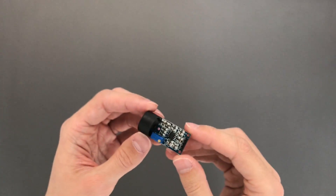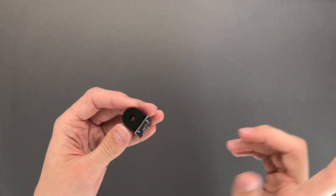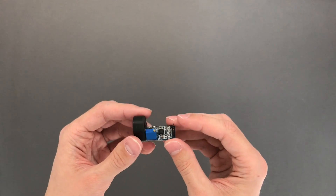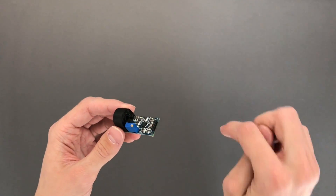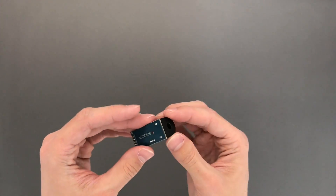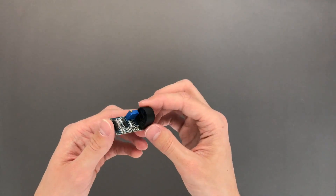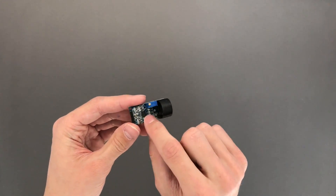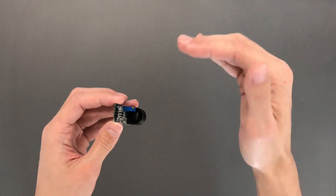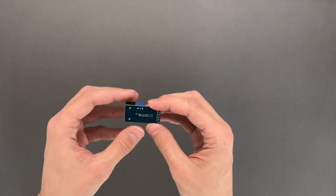In this video I want to show you how to use a current sensing donut with Arduino, and I'm going to show you a little project I did for someone. These are relatively cheap - I got this on AliExpress, I'll link it down below. I think it was around two or three dollars. It's basically a current sensor that only works with AC current, and it has a little op-amp which you can adjust to boost the signal strength to make it easier to detect with the Arduino.